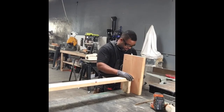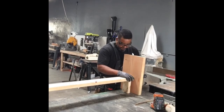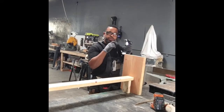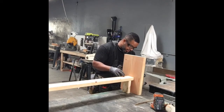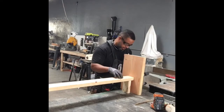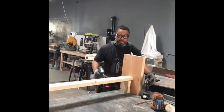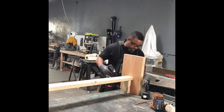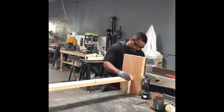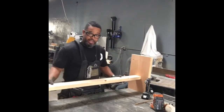I usually like to make pilot holes in line because that way the wood doesn't split and it looks a lot neater. Important thing to note: when you're doing this, make sure that as you drive the screw through the wood it's actually connecting to the piece you're trying to screw to — not like the dumb mistake I just made. Now that we fixed that problem, 3.5-inch screws give you a good grip so it doesn't move around. Now I'm gonna take these 6-inch spacer pieces off. You now have your base for your bench.